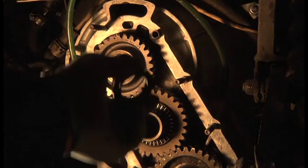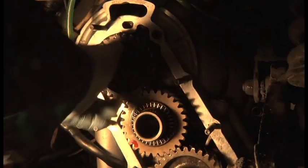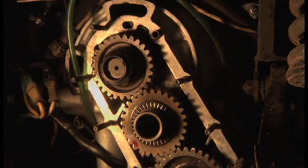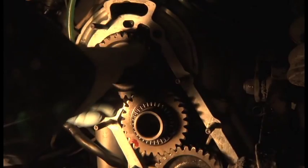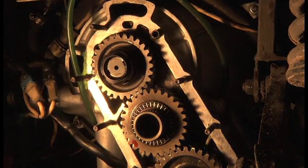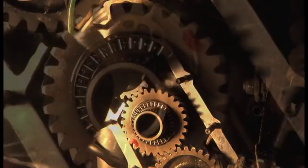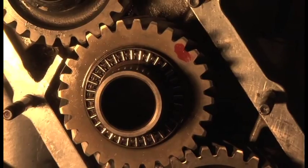And it's the same procedure again. Oiled threads. Sorry, you can't see it very well, but the threads are oiled. And I'm going to put some oil just down the back of the nut as well. So oil threads, and it's 145 pounds into that as well, and surprisingly it's the same as the other one. And there they are, don't they look lovely? They look like little jewels.